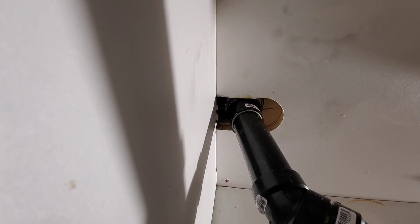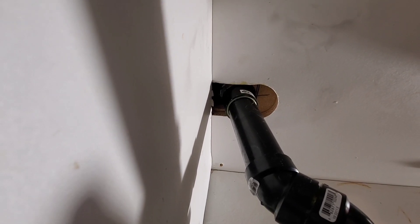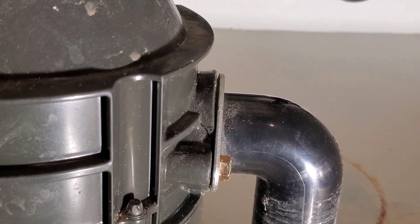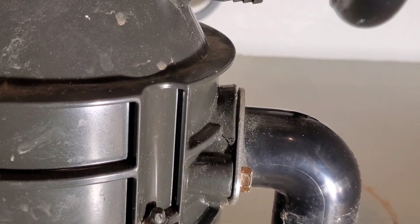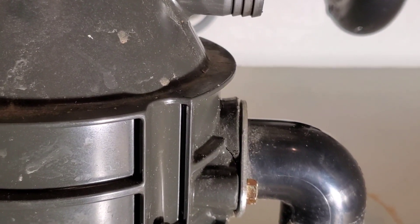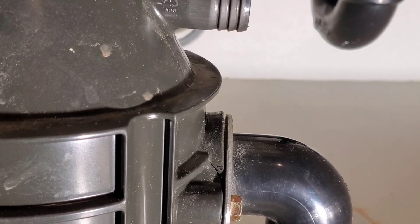Alright guys, you can see how crooked the pipe comes into the cabinet — this is just careless work. Because of this really bad angle and everything else they did here, that is why this drain was constantly leaking. As I always say about stressing old things: when I was twisting this garburator back and forth, there's a crack — and there's another crack right there. This is the first time I have ever cracked the housing on a garburator. This happened because everything here was stressed, and when you start moving around old stuff it tends to break more easily. With that in mind, we'll now do an overview of this job.